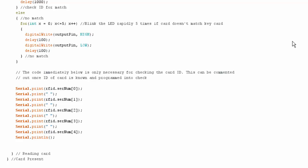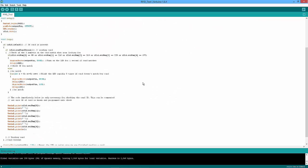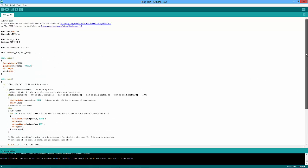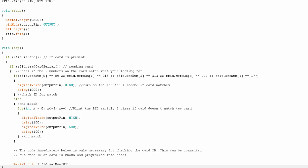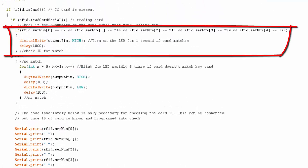You might even better put it into a separate sketch — pull that sketch up to read your card, then write your code for driving your output. You could drive a lock, for instance — I'm just driving an LED, but you could drive a solenoid-operated lock or a servo motor, anything you want. The LED is just to show the possibilities. When this reads and finds a match for the numbers, it makes the output pin high, which lights my LED, and keeps it on for one second.